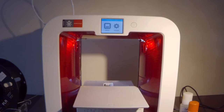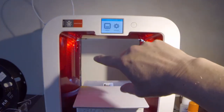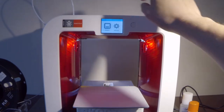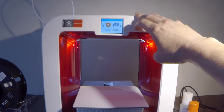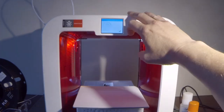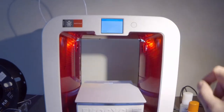So the very first thing, as soon as you get one of these, assuming filament is hooked up, and by the way, filament should never be installed or removed without the print head platform being warm, which means using the change cartridge utility. So, assuming the cartridge is already installed, you want to clean the print tip, and you would do that by purging. I do it by starting the purge utility for the print tip,